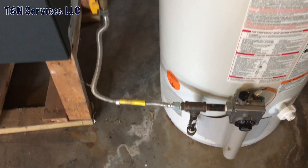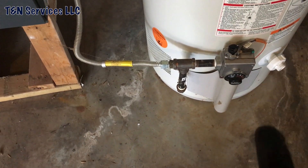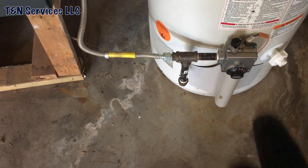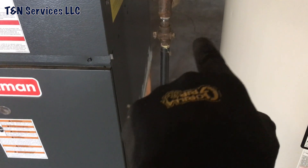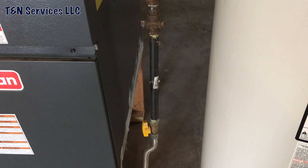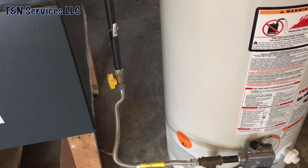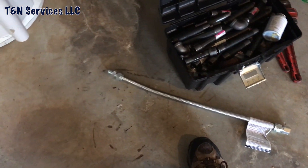You didn't really think I was going to leave that little drip leg like that, did you? Because that's not the way a drip leg is supposed to be done. I'm going to go ahead and take that little gas cock off — it's a potential leaker. I'm going to try to pipe it in straight, but if I can't I've got another gas flex right there that'll take care of it.